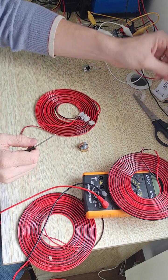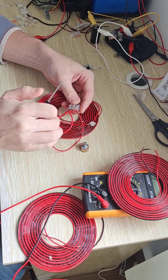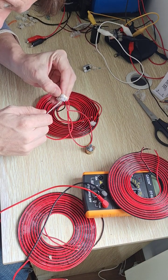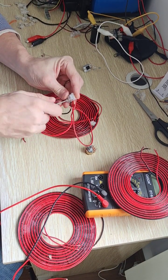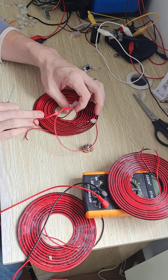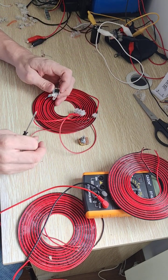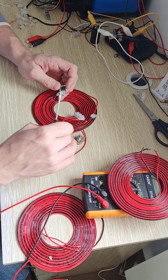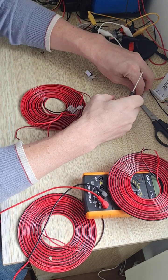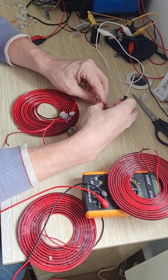So that's the centre tap for the driver. Put another wire in the middle to add the power to it. Nice and easy. And make sure everything's connected properly. Okay, so the driving coil, which is underneath, has the centre tap connected, and the other outside line of the driver coil will go to the resistor at the base of the TIP31.